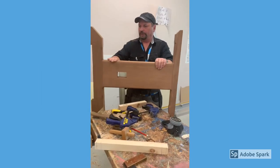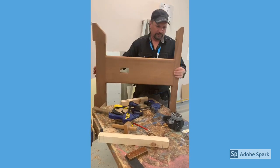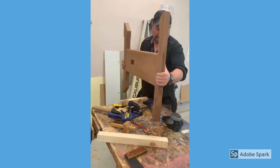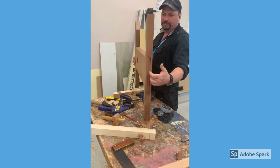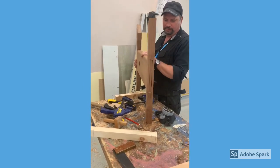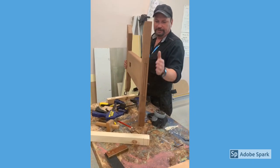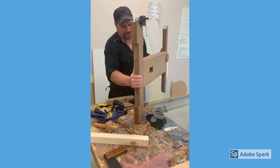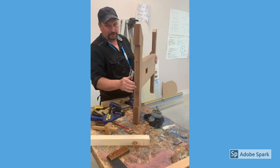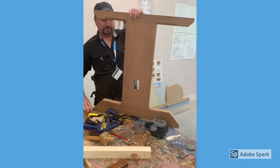This is a good indicator of where a mortise and tenon joint is used. You can see there are no nails or screws holding anything together. You have the mortise as seen here, and the tenon is the piece of timber coming through, with two wedges holding it all in place — no need for screws or nails. On the reverse side we also have our mortise and two wedges, and as a result we have our trestle completed without using any screws or nails.